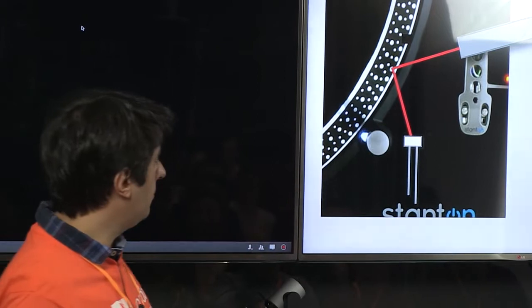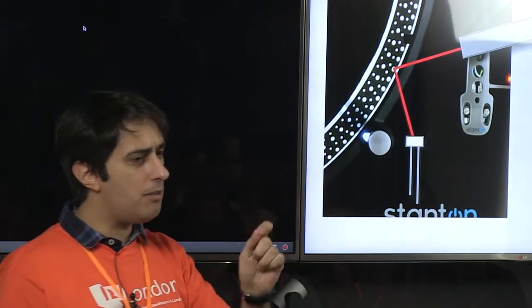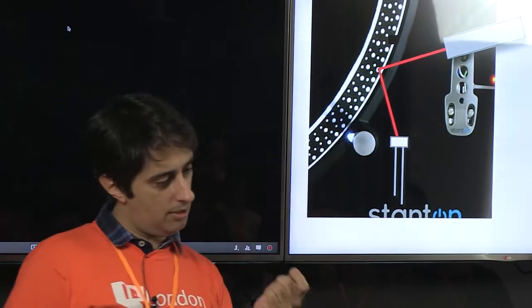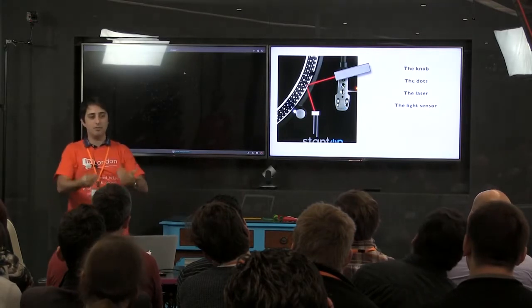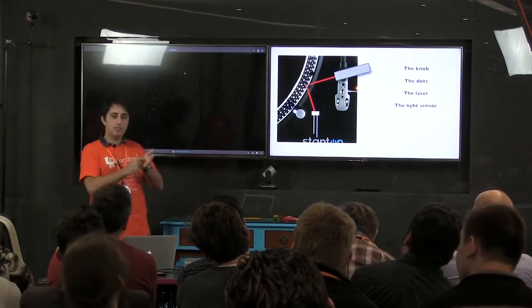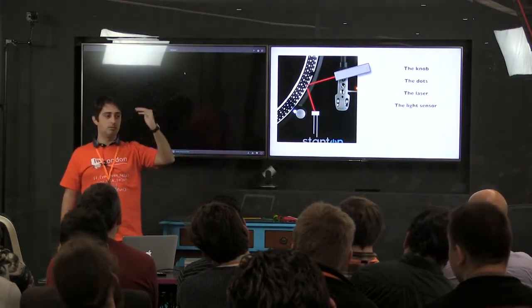And then I remembered that I have a light sensor that's very cheap. It's like 50p, even less if you buy in a big pack. It's a light sensor, a resistor that changes a number. From the Arduino point of view, it's a function that you call and you receive a number. That's it. You call a function and receive a number from a port where the light sensor is connected, and it gives a number about the light, how bright the light is.